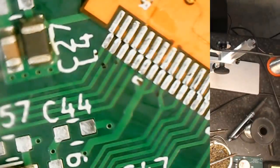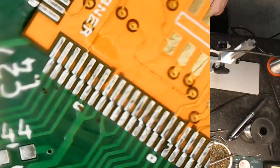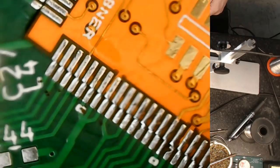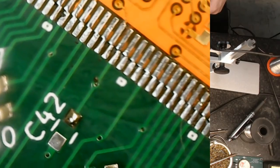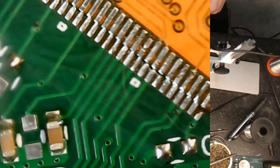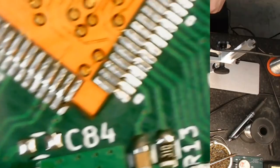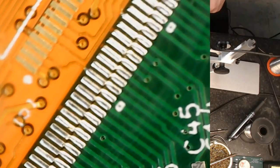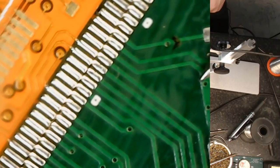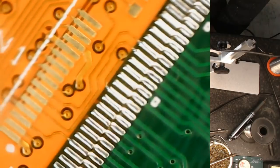Now what we really need to determine is if we have good electrical contact here, because keep in mind we are basically soldering the bottom pads of the adapter board to the main board, let's call it. I did get my alignment a little bit off there, as you will see down to that corner. I do need to get a slightly better solder fillet on this side. This side has filleted really nicely for me. So I do need to practice a bit, which is why we're doing this with this dummy board before we go right at the inverter.